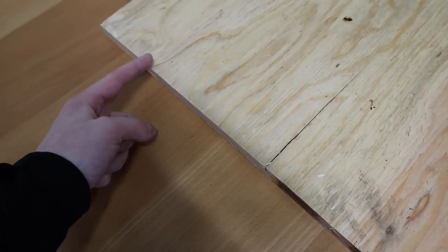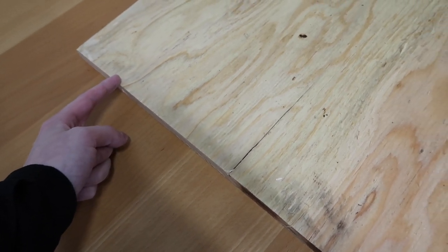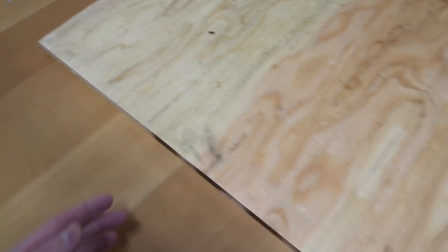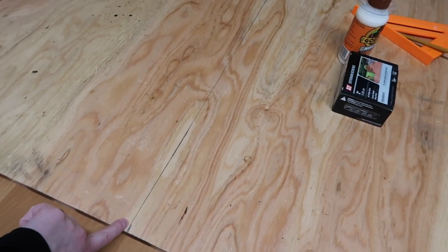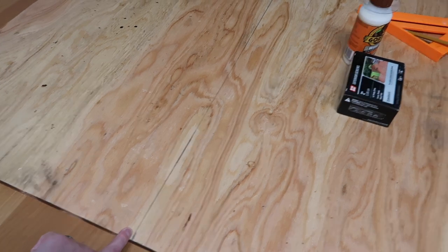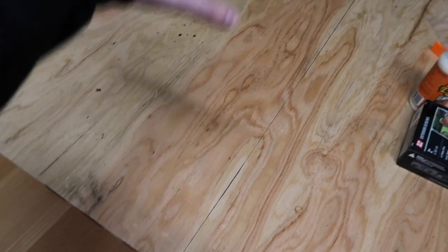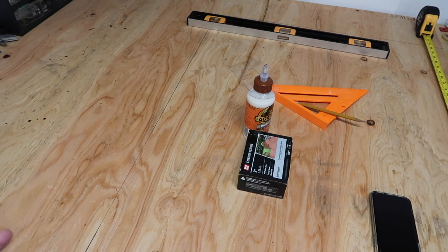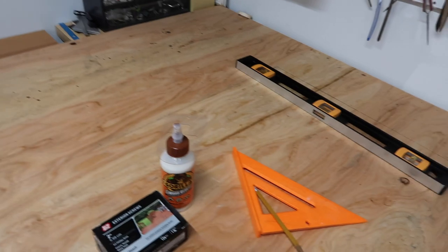And then if I wanna measure this out now, instead of measuring to 18.5 inches, I might actually measure to 18 5/8, or 18 3/4, just to give myself enough material. And that basically will mean that when I cut this one, I'll be taking a quarter of an inch out of this side if that's my blade length. Width, it's probably more like an eighth of an inch. And then when I make this cut, it should be perfect. So I'm not losing, because otherwise the box will actually start to shrink. But if those same cuts don't happen on every piece, then you're gonna have pieces that aren't the right size.